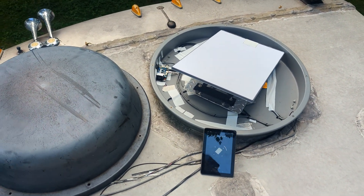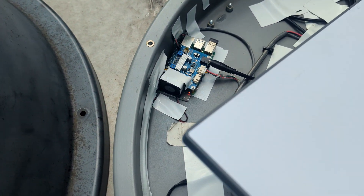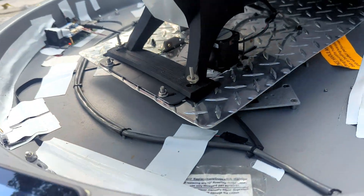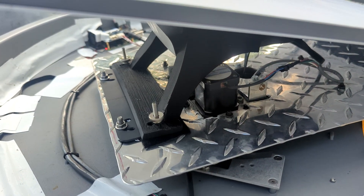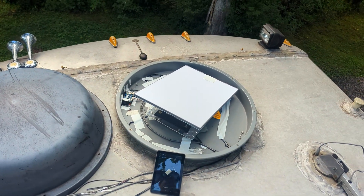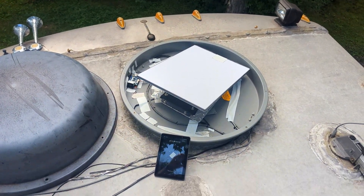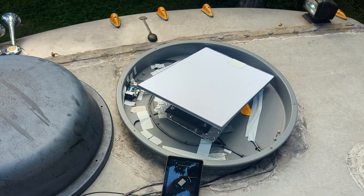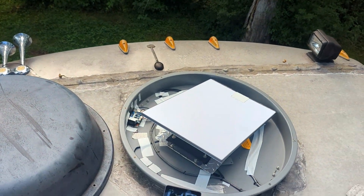It's basically using a Raspberry Pi with a stepper motor hat to control the original stepper motor and gears from the satellite TV dish. It was only able to turn 720 degrees so that it wouldn't keep turning in circles and rip the cables. So it needs to know where it's at.